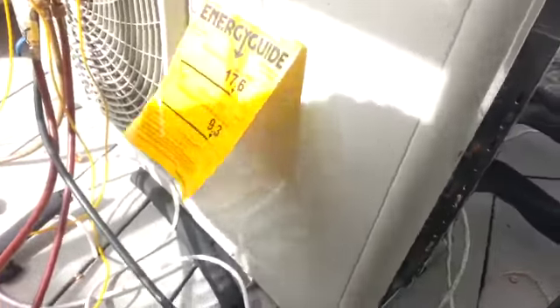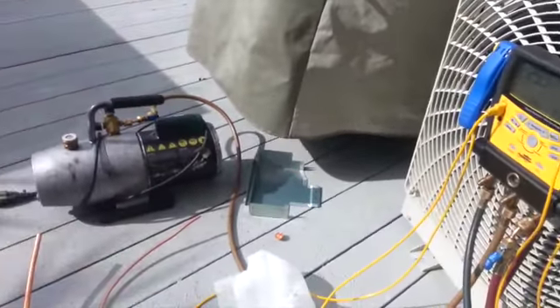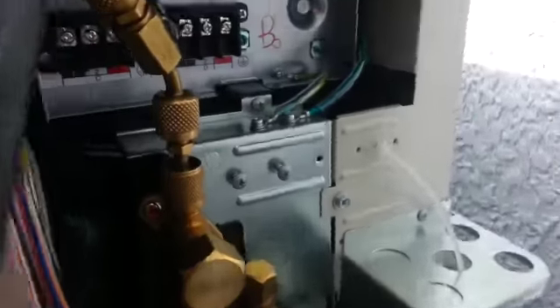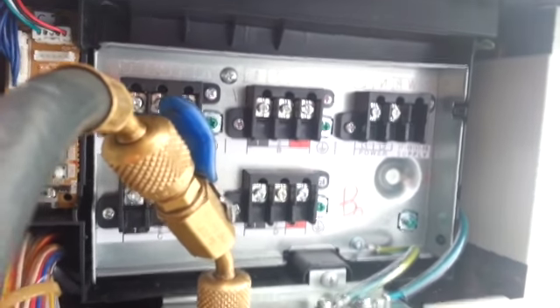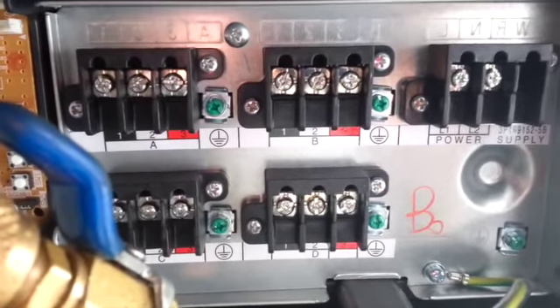I got all my flared fittings done and everything connected down here. I had to pressure test to make sure that I had no leaks — with my gauges I brought it up to about 250 pounds and I actually had zero leaks. So I just went to the next step and now I'm vacuum pumping it down, evacuating all of the oxygen and any moisture out of the system. And while that's happening, we have all of our ports here for all of our electrical, low voltage, and control wire, and what I did is label each one — this one is the B unit, and every single one has A, B, C, or D on it. Then we'll just come up here and wire them all up.